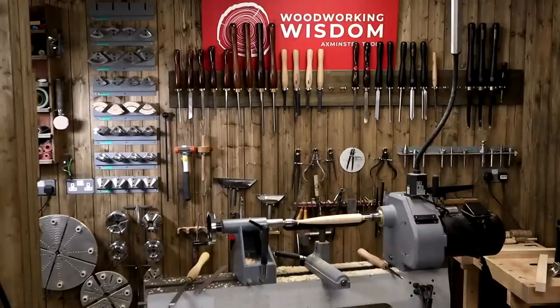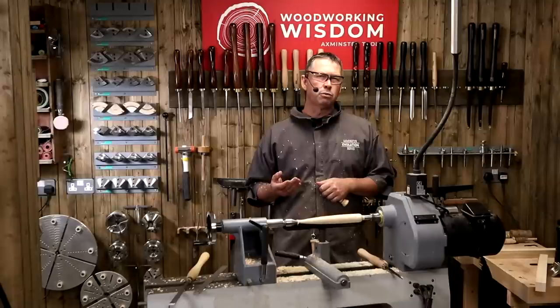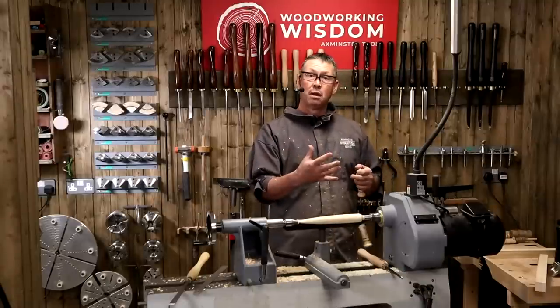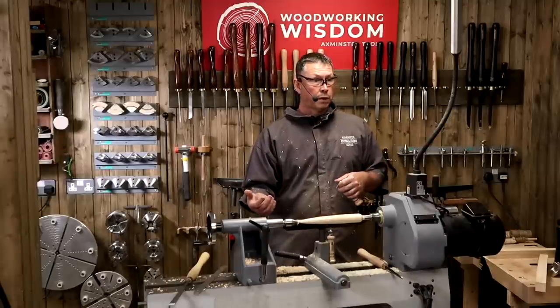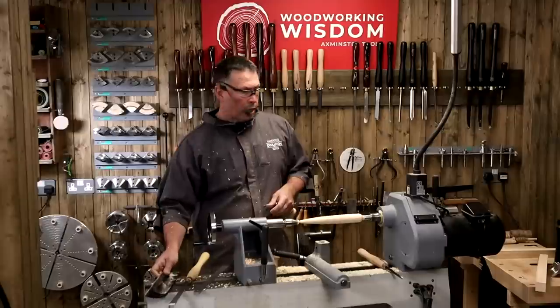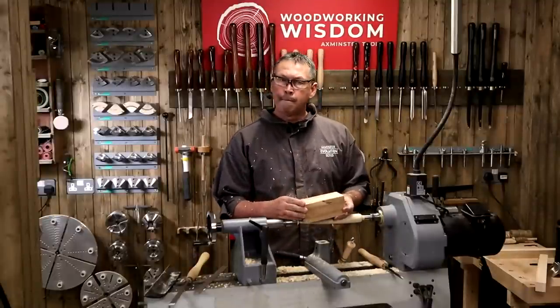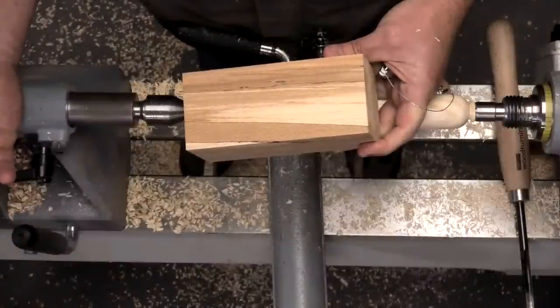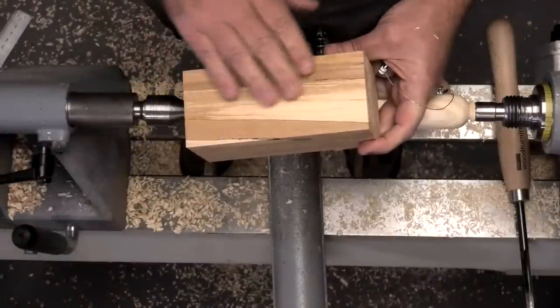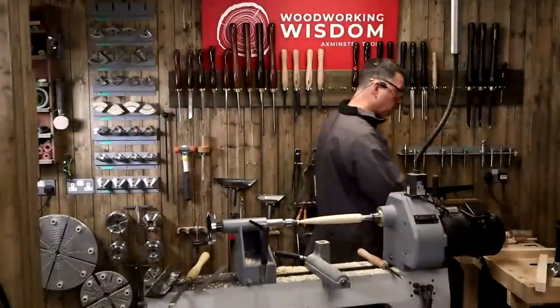Yeah, I've automatically gone for ash. And again, if I'm talking UK timber, I would say ash, oak, beech, probably maple as well. But if I'm honest with you, I can't see why most timbers wouldn't work, really, because we're not leaving them in the weathers. We take them into the shed or in the greenhouse afterwards. So I really don't see an issue with using any timber. Obviously, if it's really, really soft, then no. I am even using for the tamper a little bit of spalted material, because that's what I had to hand. Now, we know if spalted timbers get wet for prolonged periods, they're going to carry on spalting. But it's going to get wet a little bit, then dry off in the greenhouse or in the shed. So I'm not worried about using the beech with a bit of spalting even.